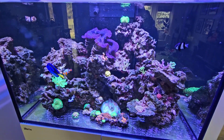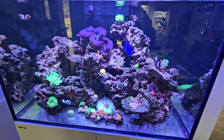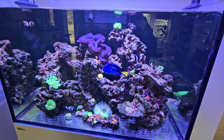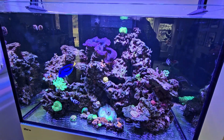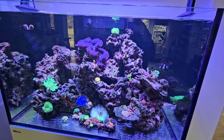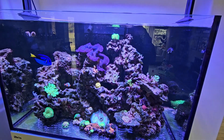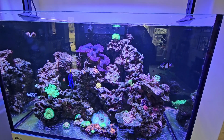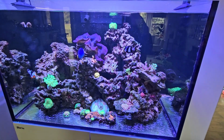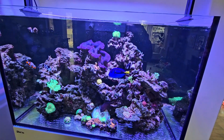One thing that really boosted it was buying that Smart Buddy pump. I can't tell you how big of a win that was in my book. It was about $130, but it's going to pay for itself. You're not going to burn through your DI resin as quickly, and you're going to make that pressure shoot up to the best pressure for your membrane. They work most efficiently at 80 to 90 psi, and I was getting 35, so I was wasting a lot of water trying to do that.